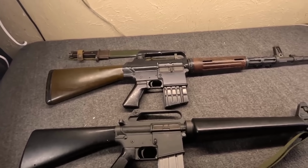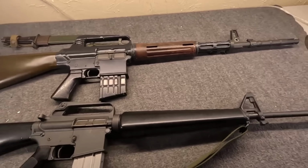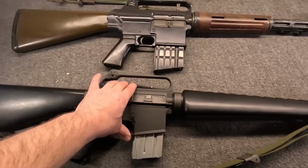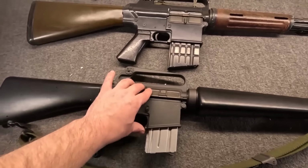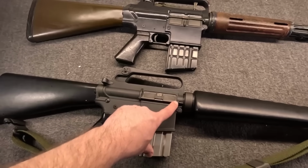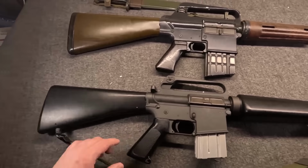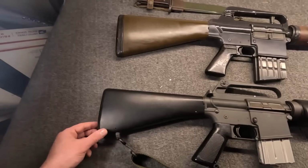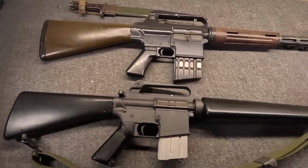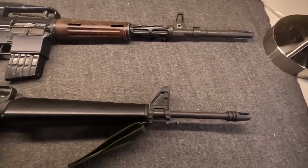So in 1959, negotiations were underway with Colt, and they would primarily focus on purchasing Eugene Stoner's direct impingement, or if you prefer, internal gas piston system. But I want to just briefly mention the contribution from Melvin Johnson, the multi-lug rotating bolt system. If you look at a 1941, you see it all the way back then. And we also have to credit Sullivan for bringing over his knowledge from the aircraft industry, mostly to do with the materials, the alloys, the fiberglasses, if not the two-piece barrel. Obviously, by this point, we're having a steel barrel.